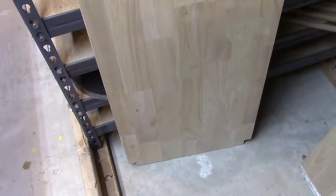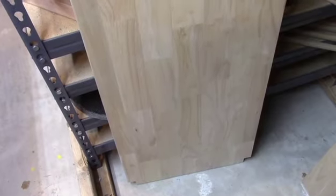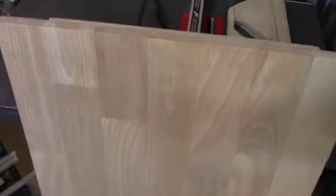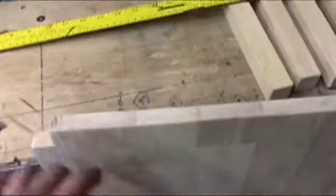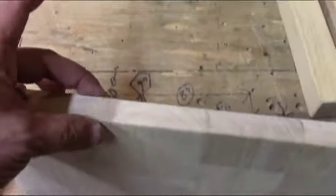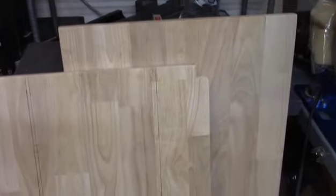All right, so my job right now is to turn these into 1 1/4 inch deep boards, which means I need to cut out sections and glue them together so that this is twice as thick. That's the first thing I need to do. And I need to make sure I find pieces that don't have slits in them. So I'm going to measure those out, cut those out, and glue them together to make solid boards. All right, here I go.